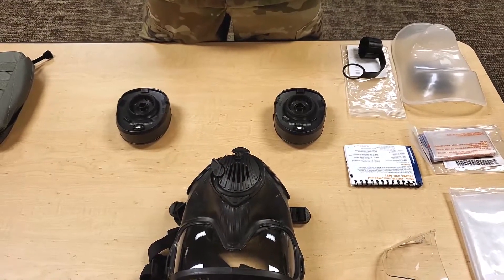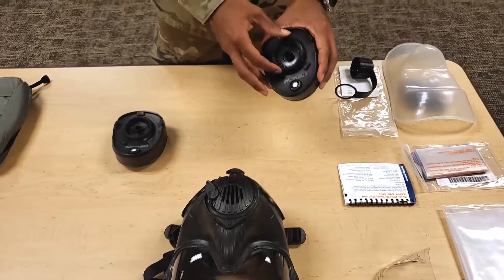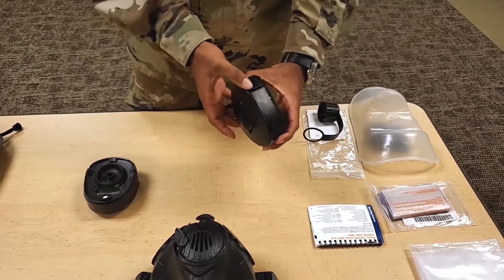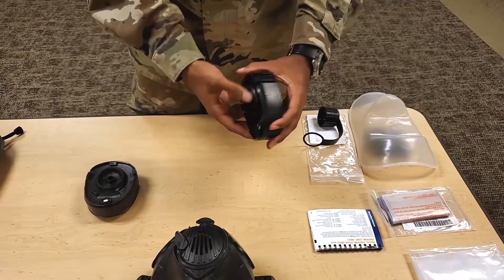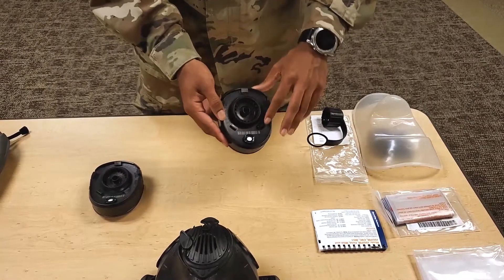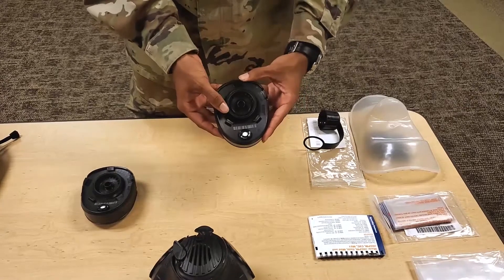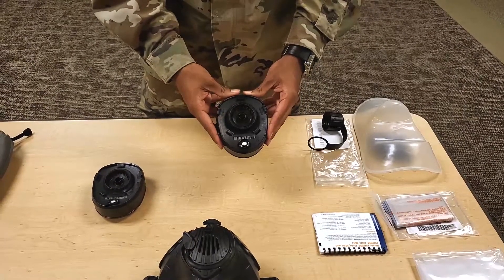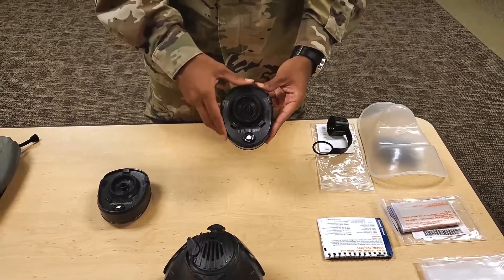Item number eight. Check that the M61 filter seal is present. Visually inspect the M61 filters for cracks, dents, or holes. Inspect the air passages to ensure a filter is not clogged with dirt. Inspect the locking tabs on both sides of the filter. Visually inspect the M61 filter for alignment markings. Visually inspect the M61 filter mounting lugs and connector surface on filter mount. Visually inspect the M61 filter self-sealing valve actuator for damage. Shake the M61 filters and listen for signs of loose absorbent particles. Inspect the filter time patch assembly housing and blotter paper alignment within the window piece. Inspect the time patch blotting paper for black or blue specs.